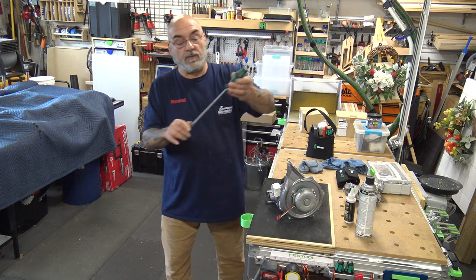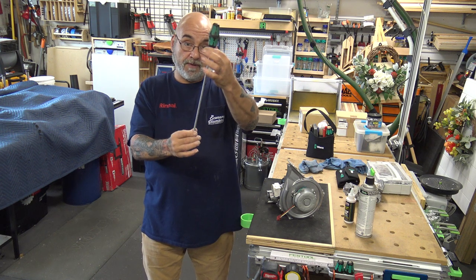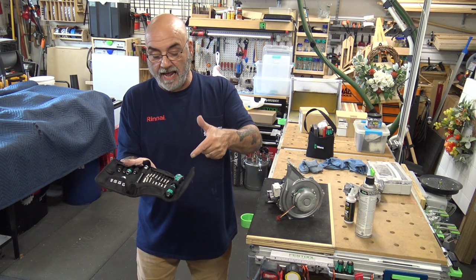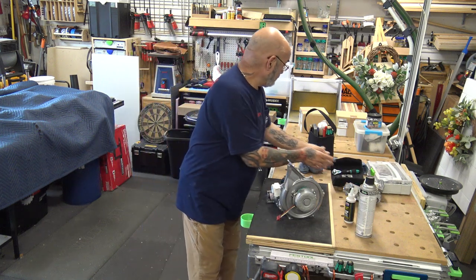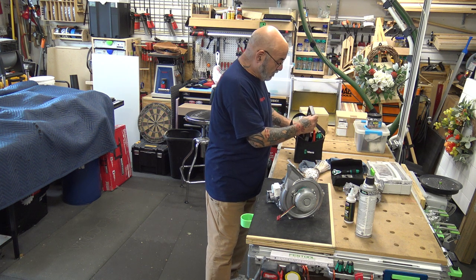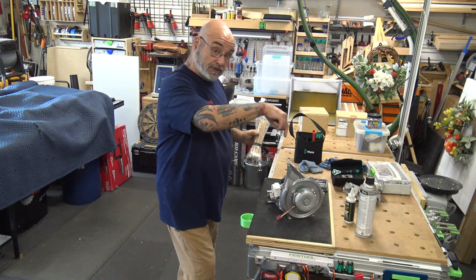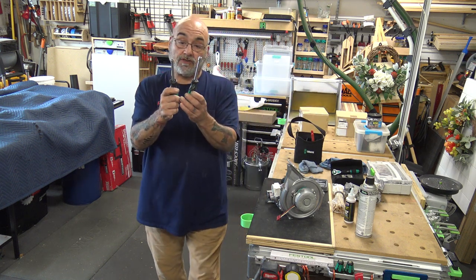All right. I bring with me a 300 millimeter number 2 laser etched tip Wera screwdriver. I bring this Tool Check Wera socket set. You're going to need a 7 and an 8 millimeter extension ratchet, and in case I do need to, the Phillips. I bring a set of picks because there are gaskets that you're going to have to remove and replace. I bring gun swabs, a whole pack of them, because they're great to get down. You'll see in a second. Then, of course, I bring a pair of tweezers. Then I bring a 7 and an 8 millimeter nut driver by Wera.